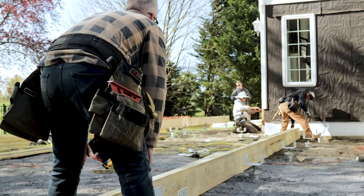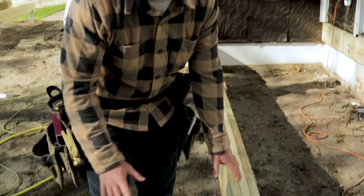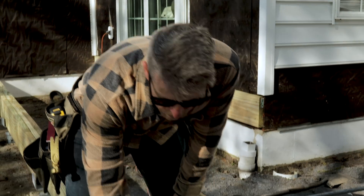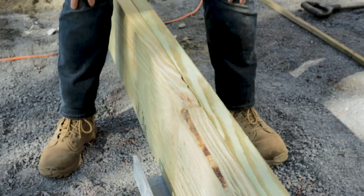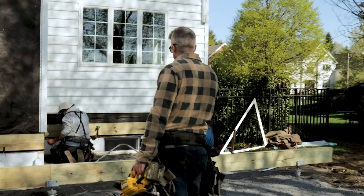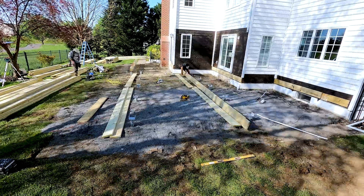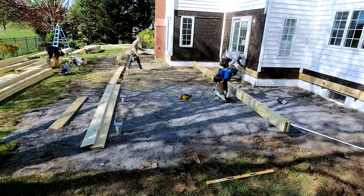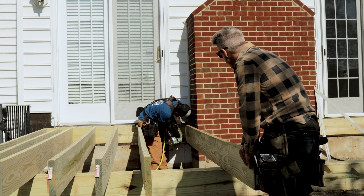We've got All Pro wood going down here for our beams and our joists. We've said this before, we'll say it again — you want to make sure any critical structure point like this, a beam, a joist, ground contact, so we've got ground contact lumber here. The other thing you want to make sure of is that all of your seams — this is longer than 20 feet so we need to splice our beam — we want to make sure that they fall over top of our saddle so that all of those points are fully supported.